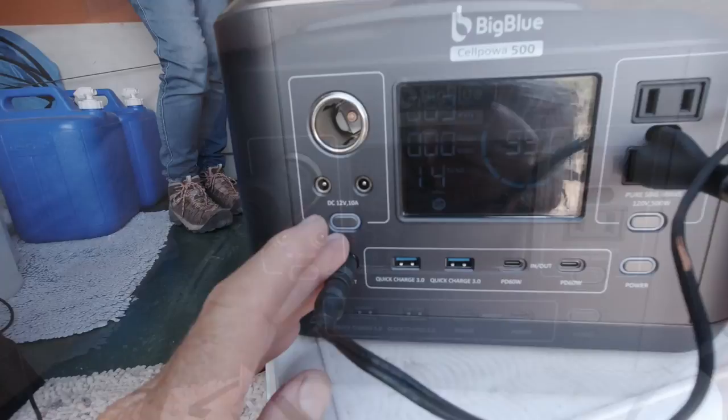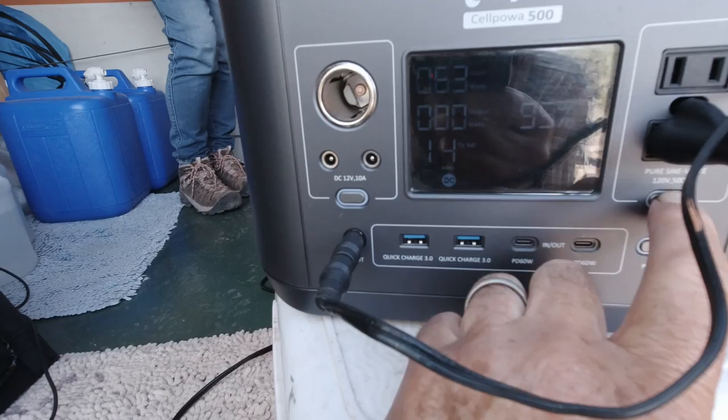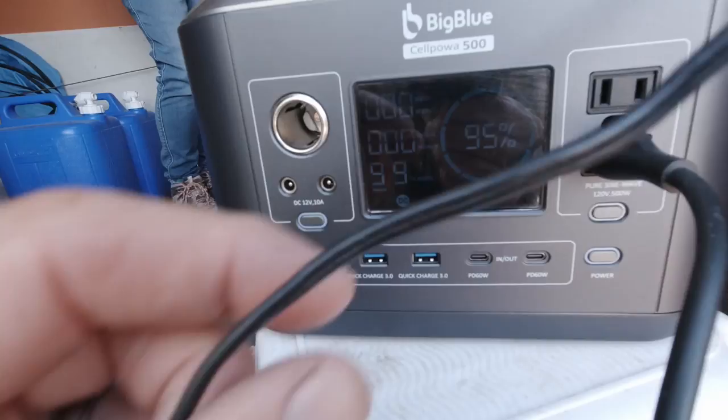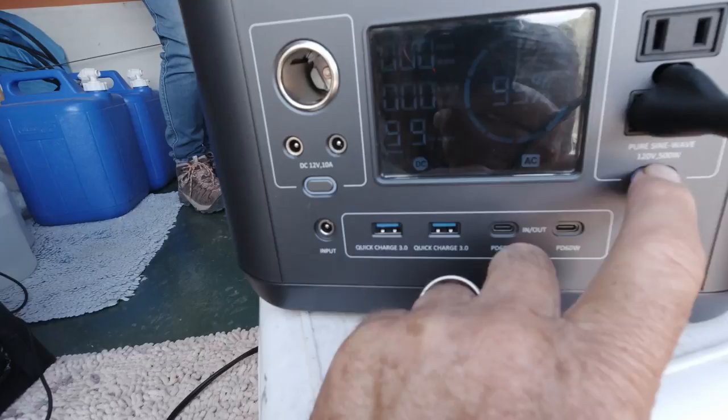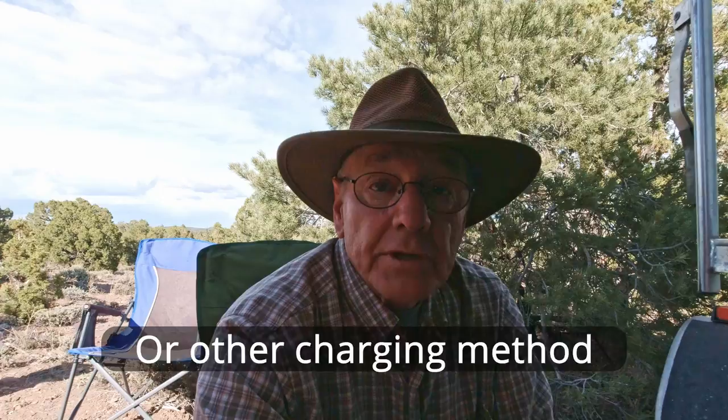I'm charging off solar here with my laptop plugged in. If I push and hold the AC switch it will not turn on. But if I unplug the solar, now when I push this — if you look in the lower right-hand corner of the screen — the AC comes on. So it senses that you've got 110 plugged into it and it will not let you turn on the AC as long as the solar is plugged in. A lot of these are that way — it is to protect that LiFePO4 battery.